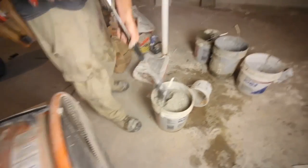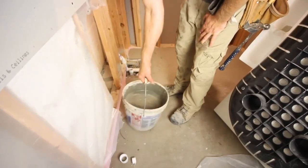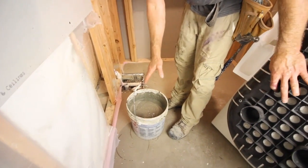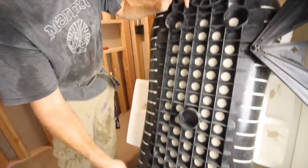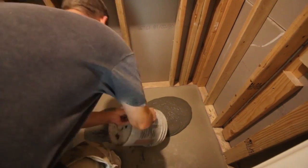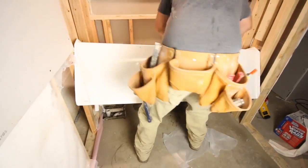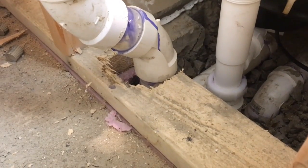We mixed up some masonry mortar — if you don't have a bucket mixer, definitely check out that tool; it's awesome for mixing buckets of mortar and cement. We have to fill in the waffles of this acrylic tub using mortar, per the manufacturer's recommendations. We always recommend following the manufacturer's directions when installing a bathtub or shower pan. We're using the mortar as a stabilizer — it doesn't necessarily have to bond to the concrete, but it has to support the tub. That allowed us to slip our vertical PVC waste overflow pipe into the P-trap fitting.